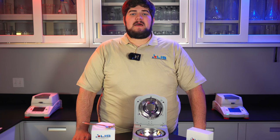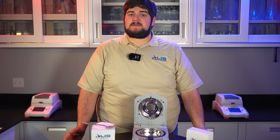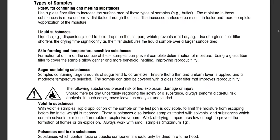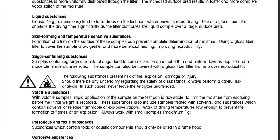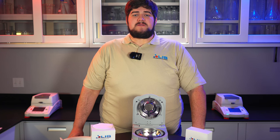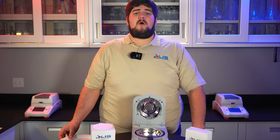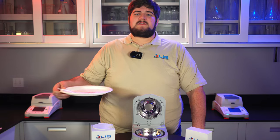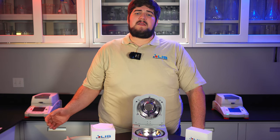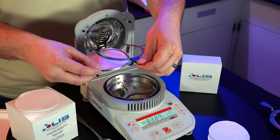Now we'll do a sample test. Do keep in mind, to keep test results consistent, I highly recommend there be a standard operating procedure in place. Please refer to the types of samples section on page EN-6 of the MB-27 instruction manual for further details on how exactly to test on different substances — we will have a link to the PDF file in the description. We'll be doing a wet food test sample with substances that go from solid to liquid such as butter, as well as slushy-like substances like sour cream, cream cheeses, or the yogurt we have here. It's best to spread the substance with a spatula all over the glass fiber sample pads so the pad can soak up as much moisture as possible and spread it out evenly, resulting in a more accurate test result.